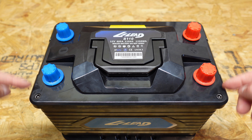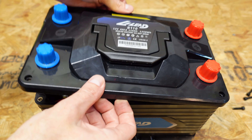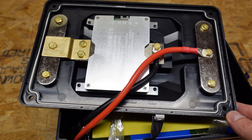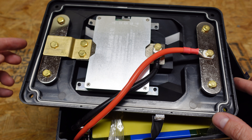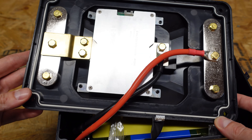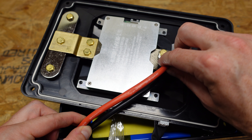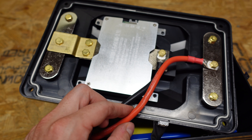Opening up the battery, there are two Allen screws on the bottom and two at the top — four total. Getting our first look inside, we can see both sets of terminals on top are connected in parallel, so there is no electrical difference between those two terminal sets. We have two 7-gauge wires with silicone insulation rated at 200 degrees Celsius.